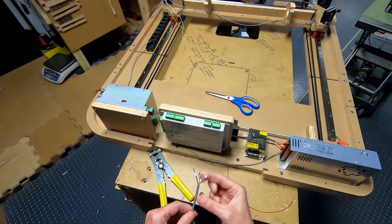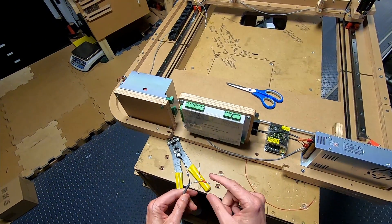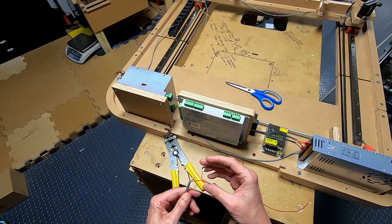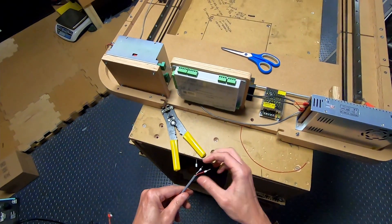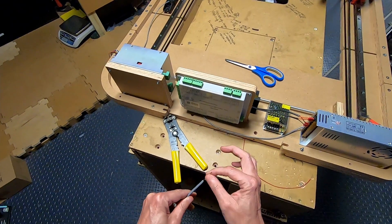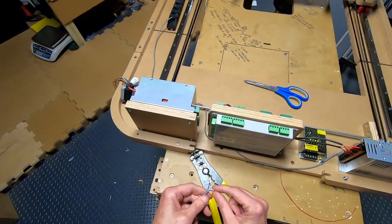On this side, you have three wires: red, white, and black. On the other side, you also have three wires, but we have a jumper on the red, so red goes to two terminals, and then we have white and black. I'm going to connect the white to the pulse and the black to the direction, and the red will go to both pulse and direction positive — but this is mainly 5 volts.